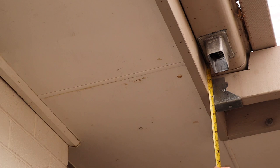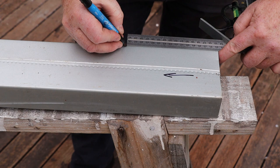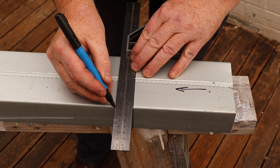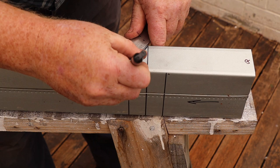Now we need to measure from the gutter to the bottom of the fascia board plus a 50 millimeter allowance for the downpipe — 150 millimeters should be enough. Our first bend needs to be cut through the back side of the downpipe, so let's start by marking our 150 millimeters. We also need lines down both sides of the downpipe. Because this downpipe is 50 millimeters thick and our ruler is about 25 millimeters wide, we can take advantage of that to mark our next two lines. On the downstream side of the joint you just need to join the two lines together diagonally.